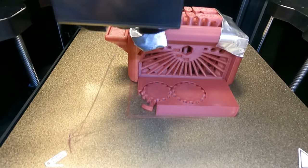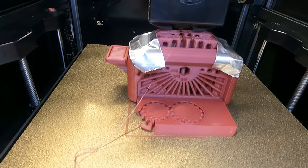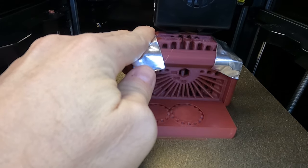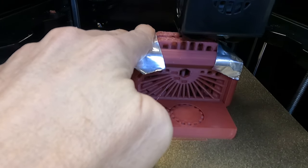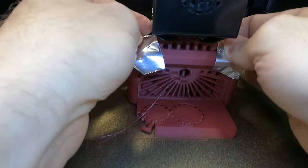I think this may be an issue with the printing temperature settings in the filament profile. If I print a little hotter, the nozzle may be able to lay down the filament smoother with a little less drag. That should allow it to print these tall, narrow structures without making them fail. After attempting to rescue this print with some foil tape, all the moving parts worked very well, and the tolerances were correct.